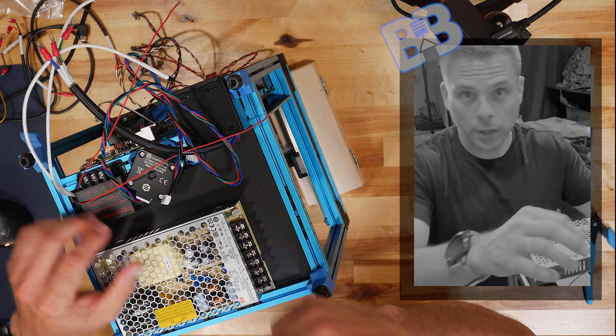Now we're going to do our 5-volt step. We're going to hook up our 24-to-5-volt converter — call it a buck converter, a DC-DC converter, whatever you like. It's going to convert 24 volts down to 5 volts. The kit's version does up to 10 amps. One of the two wire pairs goes here and the other goes to the control board.